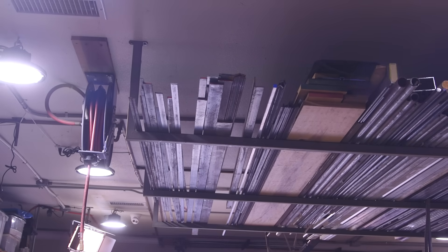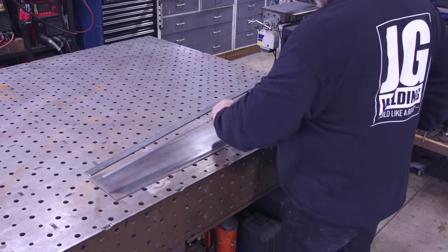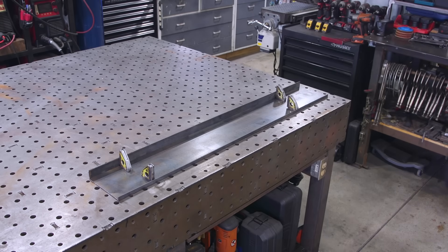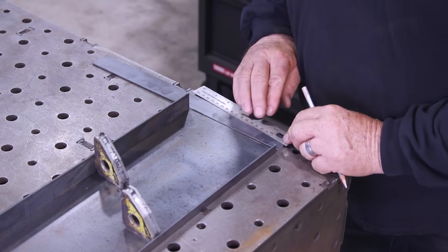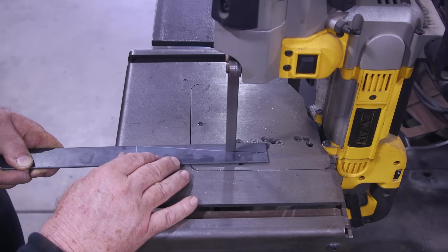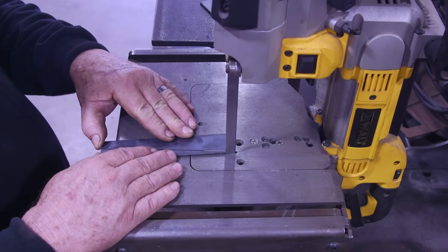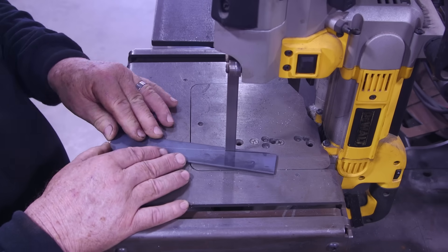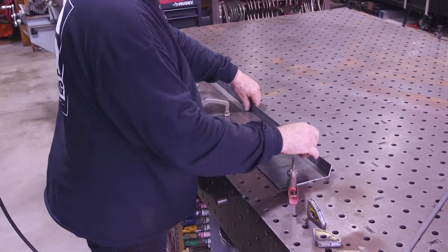With all the rust off, I've got some flat bar stock — a chunk of half-inch and a chunk of inch-and-a-half — and I'm cutting everything to length on the port-a-band. I don't have a band saw in the shop, so the port-a-band does the job. I'm test-fitting the backsplash piece and front piece, then marking and cutting angle pieces for either side. The port-a-band only has a five-inch throat, so I had to flip things around to get the piece out the side, but it all worked out.